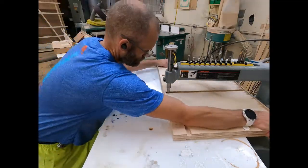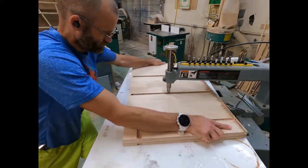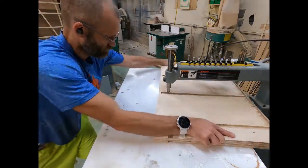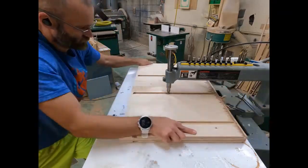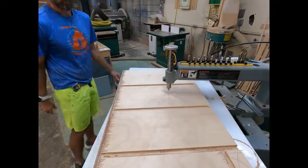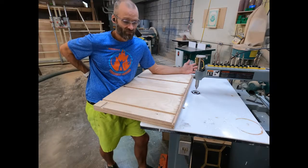2 sets of these a month, okay? I make 4 cabinets a month of this, right? I save myself all those operations by just making one pattern of each side, right? So I make a pattern of each side using Baltic birch or MDF, and then I have that tool forever, as long as my dimensions stay the same.